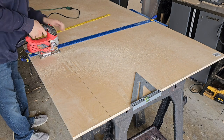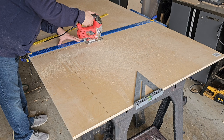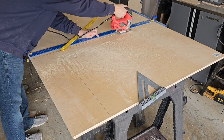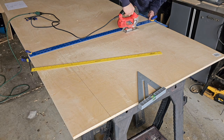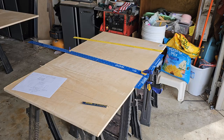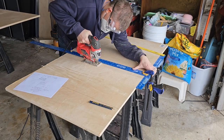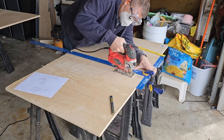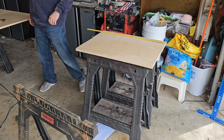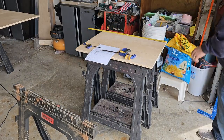I'm using a jigsaw for finer cuts into the four by eight piece of birch. Using a T-square clamped down gives me an edge to guide the jigsaw down the wood for a perfect cut. This new section I'm cutting is specifically for the three largest or tallest sections of the back box — the back panel and two side panels. This allows me to make sure all the smaller components will fit on the other piece of birch and gives me room if I make a mistake and some extra material.